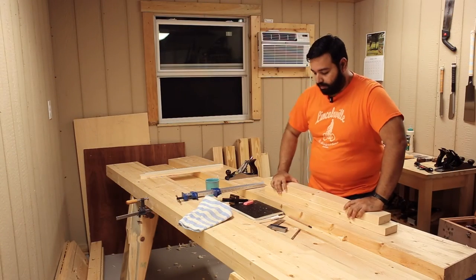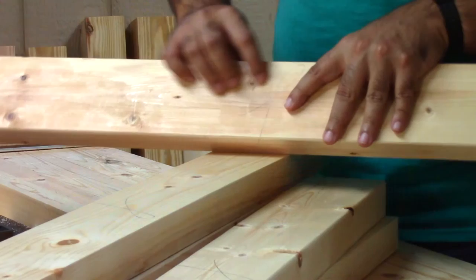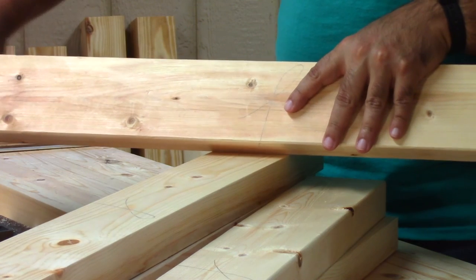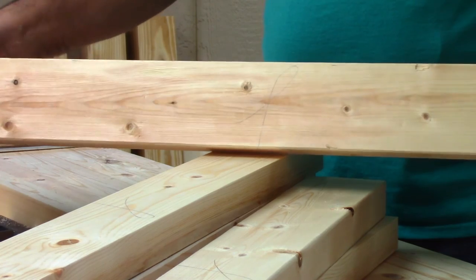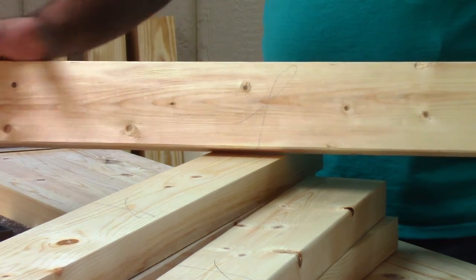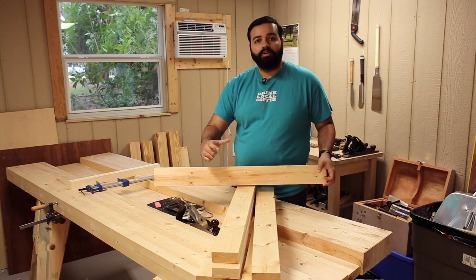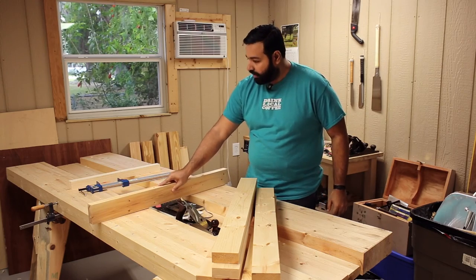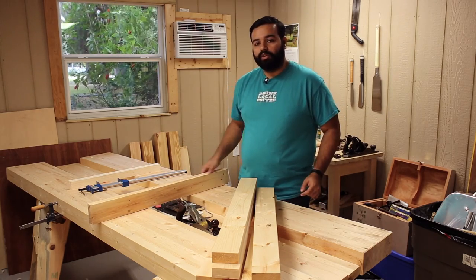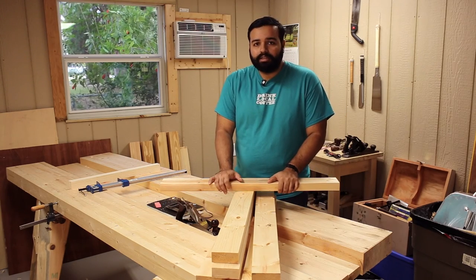When I see you next time, I will have four more pieces that look like that. All these 2x4s are cut to the same length, which is about 33 inches — this is the largest dimension I need for the stretchers and the bearers on this workbench. You can see this spans the width of the workbench and a little more, with a bit of an overhang. All 6 boards are planed.